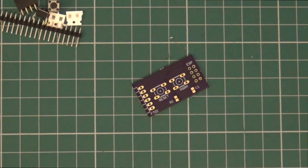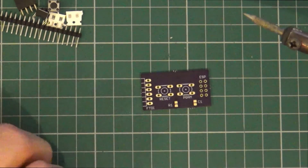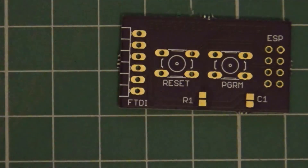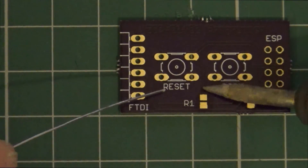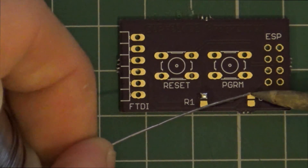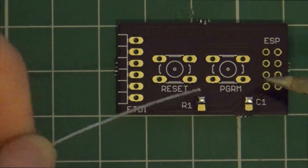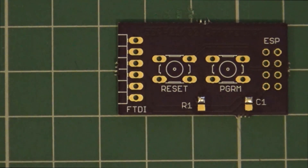Now, the best way to do this is to solder one side of the pad — makes it so much easier to then connect the component to the board. Apologies for any inaccuracies because I'm doing this at a distance so I don't get my big head in the way of the camera.